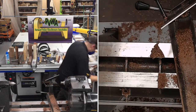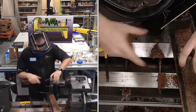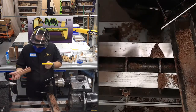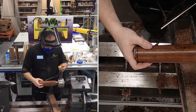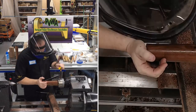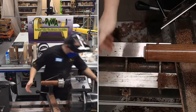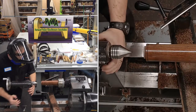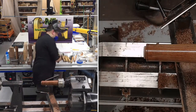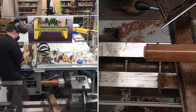Yeah, I wanted to leave that on there, but that's all right. Okay, so now I got these finger jaws, so I'm going to expand into this. So again, reason to have a real flat base there, so you can expand into that, have it flat out here. It's probably going to be a little off, just because it never lines up straight. And if you remember, we talked about the 1 1/16 bit to give us room for the top piece, this piece to go into. So we're going to do that real quick.